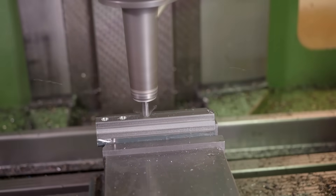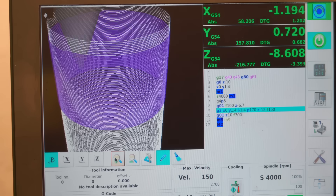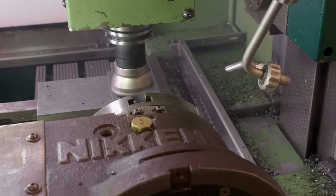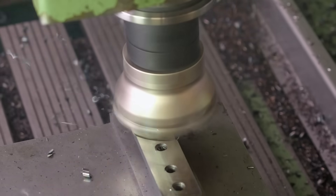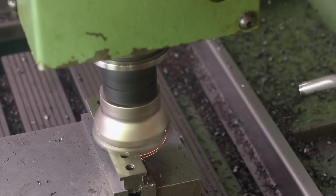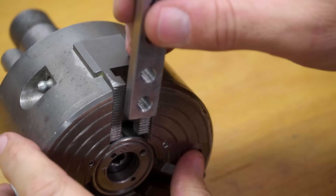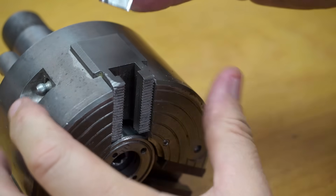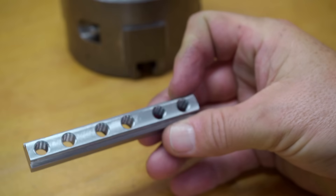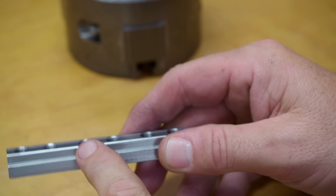I already covered drilling and tapping these parts — actually breaking off a tap and then having to mill out the damage — in a previous video, so I'll leave a link up in the top right for that. I can now take those out, flip them, and machine the other side. The blank has a nice fit across the thickness but it's tight the other way. Since this has put so much work into surviving, I'll put it in the furnace with some case hardening powder to diffuse the carbon into the surface — but not harden it yet.